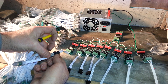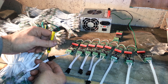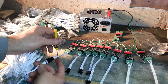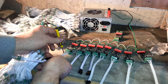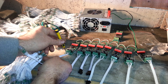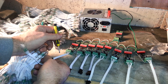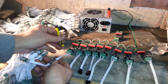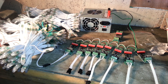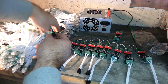Now I have these upside down for a reason. When I connect them, I need to make sure this is the red, the positive, the green, the blue. So this one needs to go to the red — and it does, right there. The middle one, second to the left when flipped, is actually going to the positive 12 volt. This one here needs to be going to the green, and it is. The far left one needs to be going to the far right one, which is your blue. Once I verify I've had them all hooked up, that's the next step — take these one by one. Oh, that one doesn't fit that way. We'll have to plug this one over here.